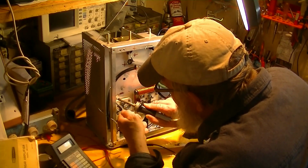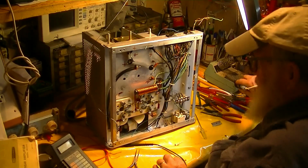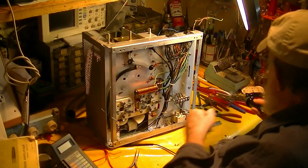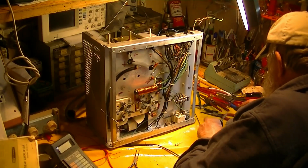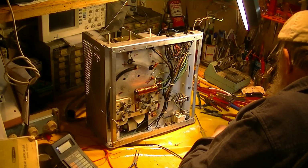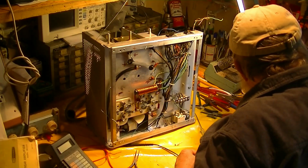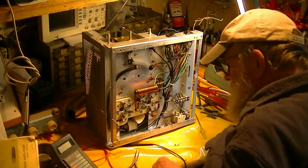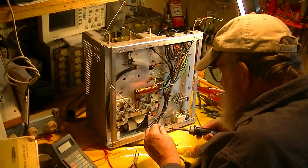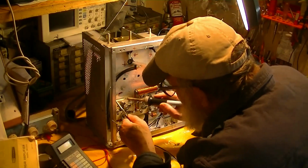in various spots. Now it's hard, after the fact, to figure out what the guy was doing. Why are there wrong values in the ALC circuit? Was he doing that to accommodate the needs of some modern solid-state radio? That's possible. Was he doing it because he couldn't use the color code properly and couldn't tell the difference between 2200 ohms and 22K? This is also quite possible.